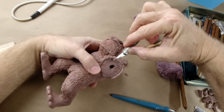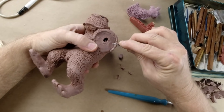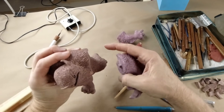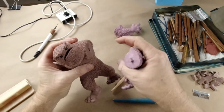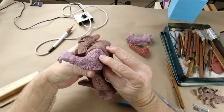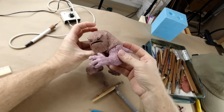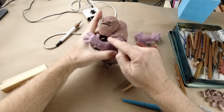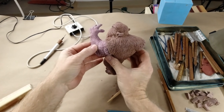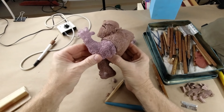So what we're going to do is cut them all off and literally make this a flat surface. The penalty that Larry, who sculpted Mr. Foot, is going to have to pay is that he didn't plan for molding and casting. If we flatten this edge we're much less likely to catch bubbles, and even if we do, it doesn't really matter much because once we fit the arms together he's going to have to sculpt the connection. I'd recommend he uses magic sculpt or epoxy sculpt to make big massive hairy shoulders that completely close up that connection. So this casting is going to require some post-sculpting — it just is.